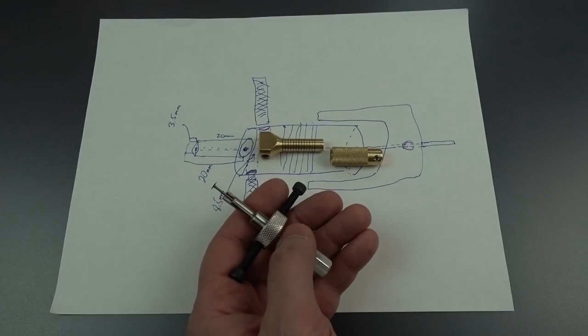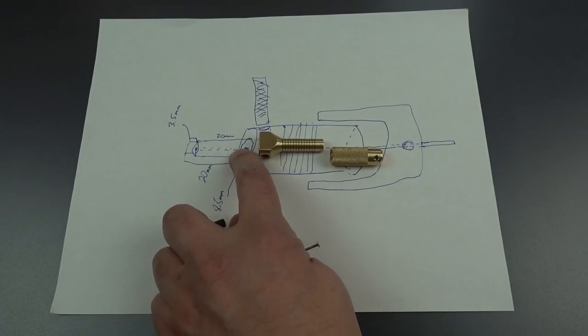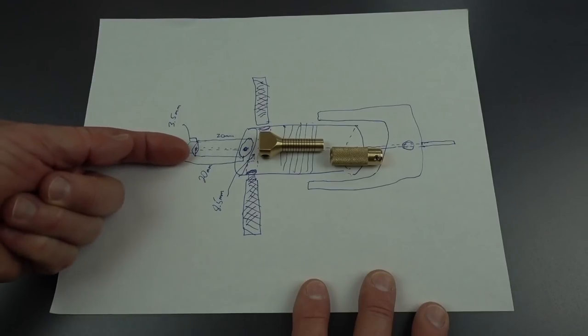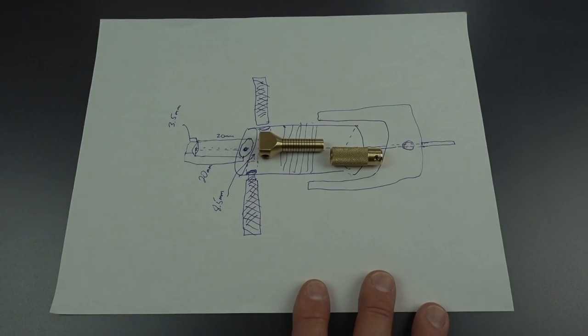The only thing I'm concerned about is drilling a really tiny hole all the way through a piece of tool steel. Well, I run into problems with that too. Why don't we drill roughly half of the way through one side and then flip it over and drill it from the other side? And when they match up, we'll have a good idea of how closely they're centered to each other. Makes sense. Let's head down there and give it a shot. All right, I'm with you.